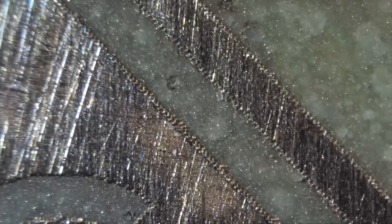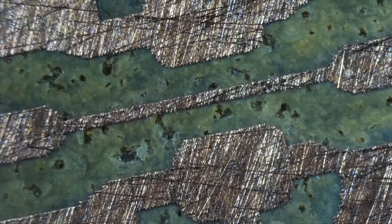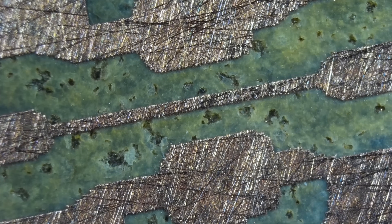It's really cool. You can actually see all the kind of little pixels of where it's actually trying to ablate — that fine resolution of the galvos in the head, I'm assuming that's what we're seeing here. This is a 200 micron trace width right here, which is about 8 thou. I think we could easily get down to 6 thou trace space, like no problem at all.